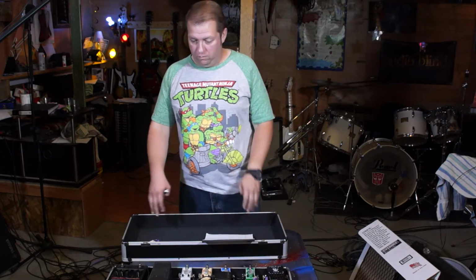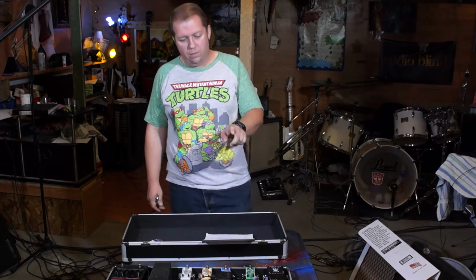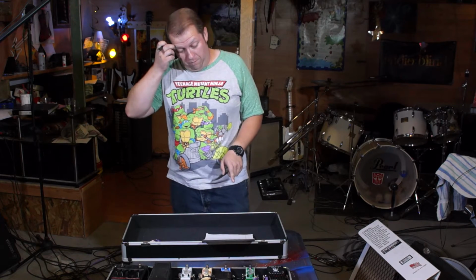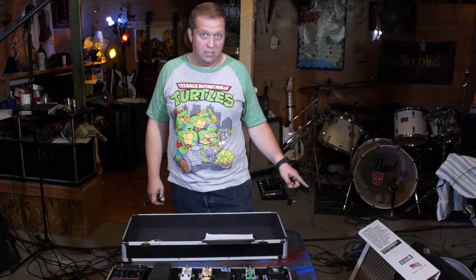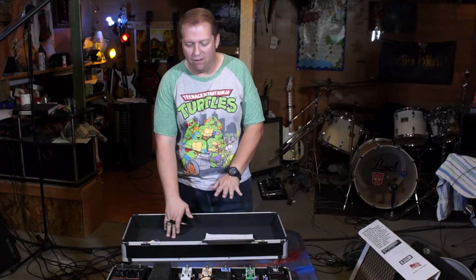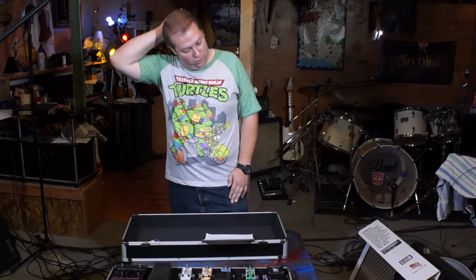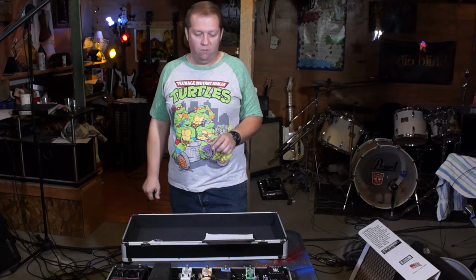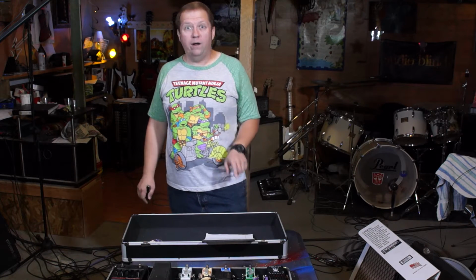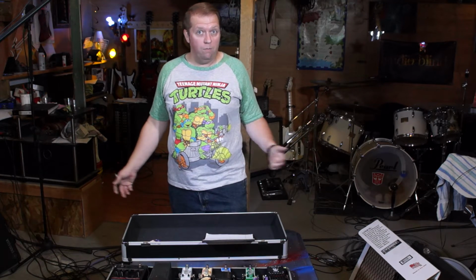So after measuring our box, pedals, and the power supply, and the other pedal we want to go underneath, surprisingly, the power supply is exactly 1 5/16 inch tall. The expanded metal is right at a 1/16 inch thick. And that is exactly how much space we have from the height of our pedal left over. Everything works out exactly. So as long as my measurements are right and I don't screw up, we need riser boards that at one end are 1 inch and at the other end are 1 5/16, and then we'll be able to just screw the expanded metal directly to it, and we should, in theory, be wonderbar.